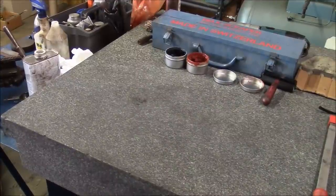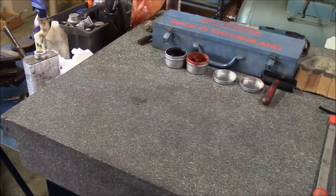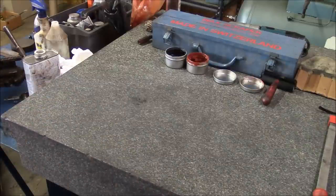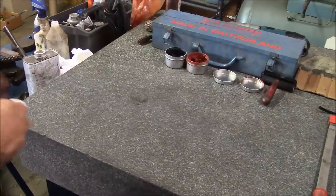I'm just going to lay out some black on my plate and we'll take a rub on this angle plate that I'm messing with. It looks like I was scraping on it once before but I have no idea where it's at, so we'll kind of start over. And by the way, if you're squeamish about discoloring your surface plate, don't use the oil-based pigment that I use - it'll stain it pretty good, just like Dykem will. Eventually the UV rays will bleach out all the pigment but it takes a while. I was doing some scraping at a customer's shop one time and I put some Dykem Layout Blue on their surface plate and they just had an absolute fit about it - it's a pink surface plate, and it had a nice big permanent blue spot on it and they didn't think much of that. So you've got to be careful about things like that.